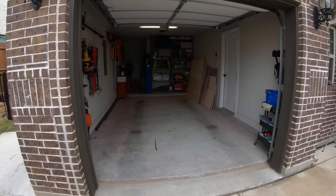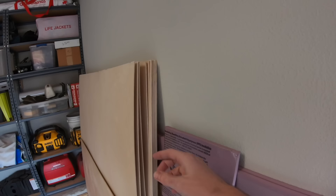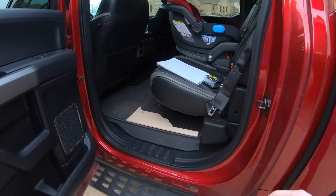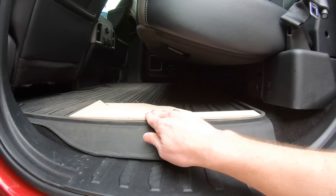To make our toolbox today, we'll be using wood. I did consider making it out of metal, but today we're going to use some wood — specifically this six-millimeter-thick birch plywood. It is six millimeters; we're in the US but this is Russian birch, so it's imported and measured in metric. Six millimeters is approximately a quarter inch thick, which should give us just enough room to clear our floor mat. The floor here is kind of curved a little bit, so it might sit up a bit, but if it sits all the way down it should be just enough for the drawer to clear.